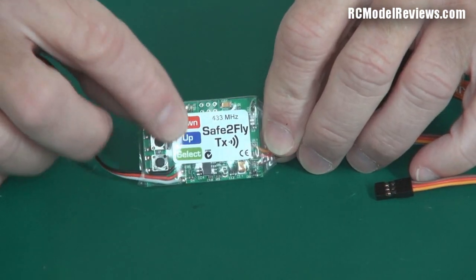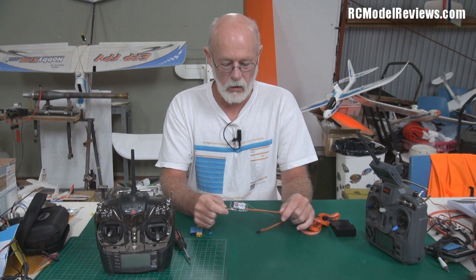In part two of the review, I'll put this in my AXN and give it a fly to see how well it works. The AXN has a four-channel receiver, so I'll use alarm mode — it'll just tell me when the battery's low, altitude ceiling reached, or something else happens. Then I'll put in an eight-channel receiver and test the on-demand telemetry. The wind's not cooperating today, so I'll have to wait for a better day. So far, I have to say it's well made, designed to a price point, and provides a level of functionality most people will find useful. Thank you for watching.